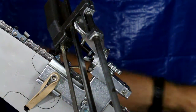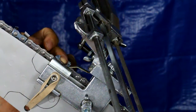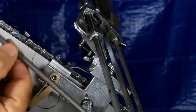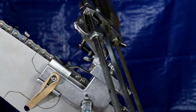The file lasts quite a long time because most of the work with round filing requires cleaning the gullet separately — doing both at once means wearing the file out maybe four times faster since there's a lot more metal to take out. Here I use a 7/32 round file just for gullet cleaning, so only the top 16th of an inch is actually wearing out the chisel bit file. They last a good long time. They're expensive — somewhere between eight to twelve dollars depending on how many you buy — but the cost of the files is not really a major factor.